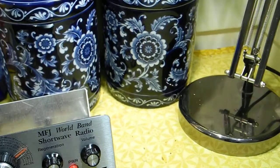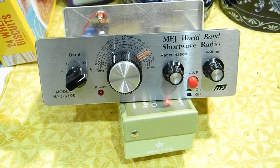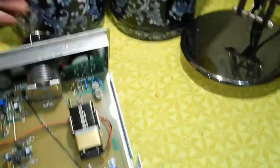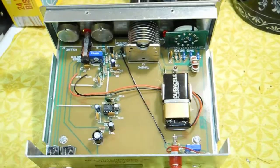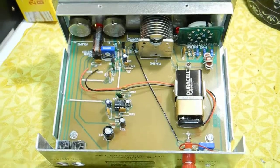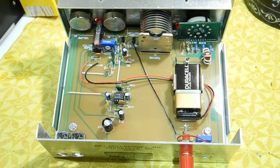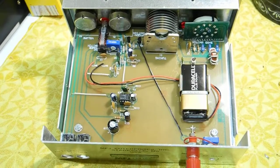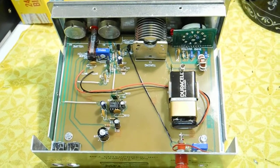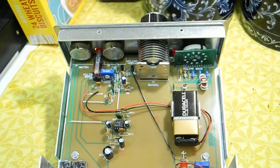You've got three positions on one side and two on another — it's really ridiculous to have a switch like that. But anyway, it's what it is. It's a regenerative radio. I'm going to flip it over so you can see inside. It's been very well put together, soldered with unleaded solder by the look of it. I wouldn't use that — it's not very good. I always use 3% silver or 60-40. You need more heat for unleaded and it always looks like a dry joint to me.